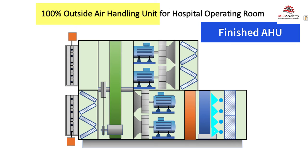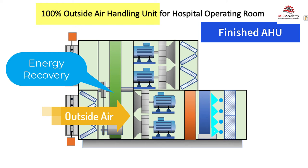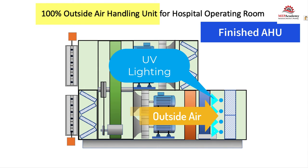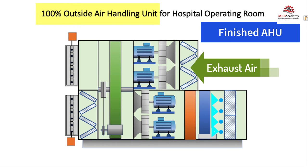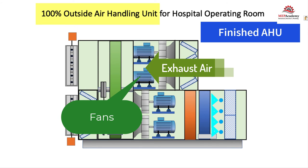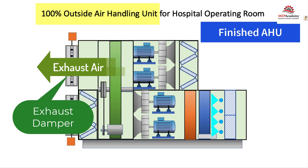As you can see, the air will enter the outside air damper, go through the pre-filters, and then through the energy recovery wheel where it will recover energy, through the fan, into the coils, and then the UV lighting system will kill the germs. It will then go through the final HEPA filters before it enters the operating room. Coming back from the operating room, we'll exhaust the air through the filters, through the fans, and then capture some of that energy in the energy recovery wheel, and then through and out the exhaust dampers.